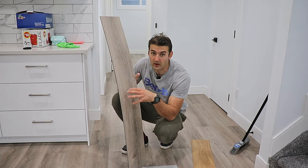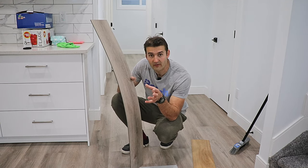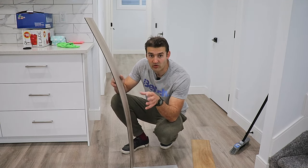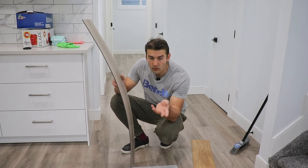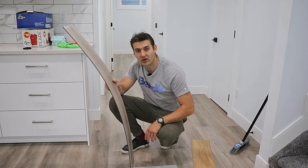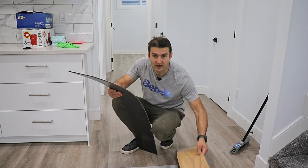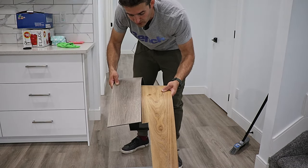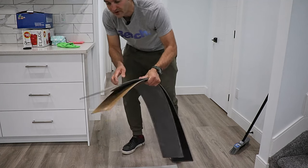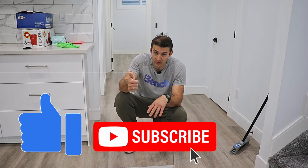With glue down, I promise it's going to be much, much easier. I will 100% recommend glue down flooring — it's a real DIY project, it's not hard to install. I have a video on how to do it. You just have to be really precise on your first row or two, and after that it goes easy. You spread the glue throughout the entire room and keep setting piece by piece. When setting the pieces, you really want them tied together. Check out the video and I think you'll have a good idea how to get it done. Thank you for watching — leave a comment below, give it a thumbs up, and subscribe.